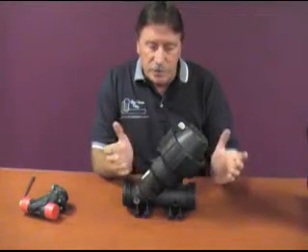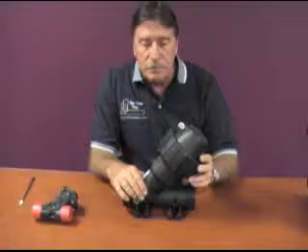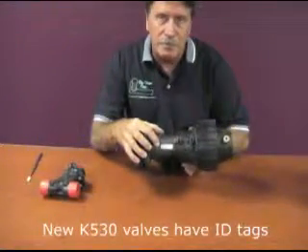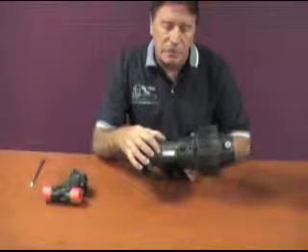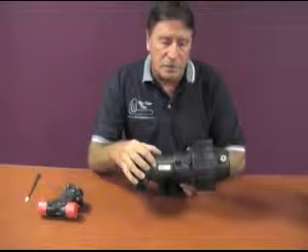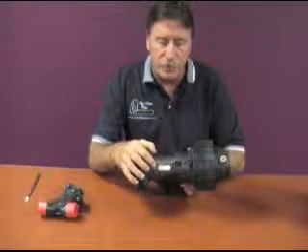The valve has many options that the other valve did not have. This valve now has an identification tag on it, right here, which gives the complete part number of the valve. It tells us everything about the valve: the type of internals, the accessories, the operation of the valve, whether it has limit stops, whether it has position indicators, what kind of internal material it is, and the size of the valve.